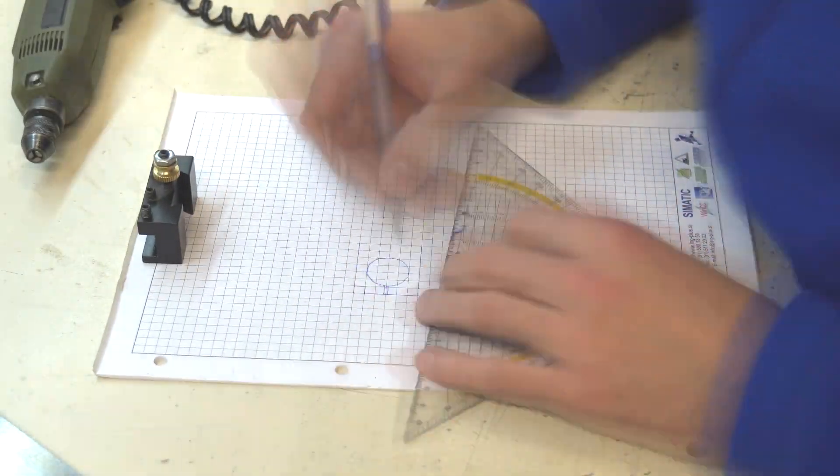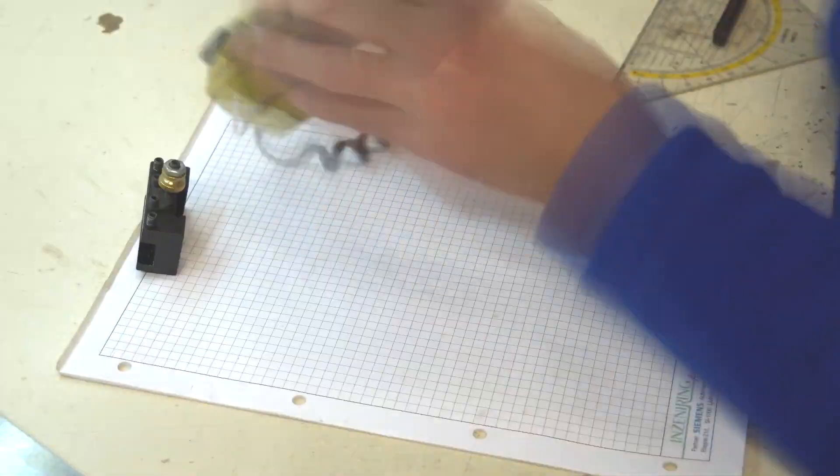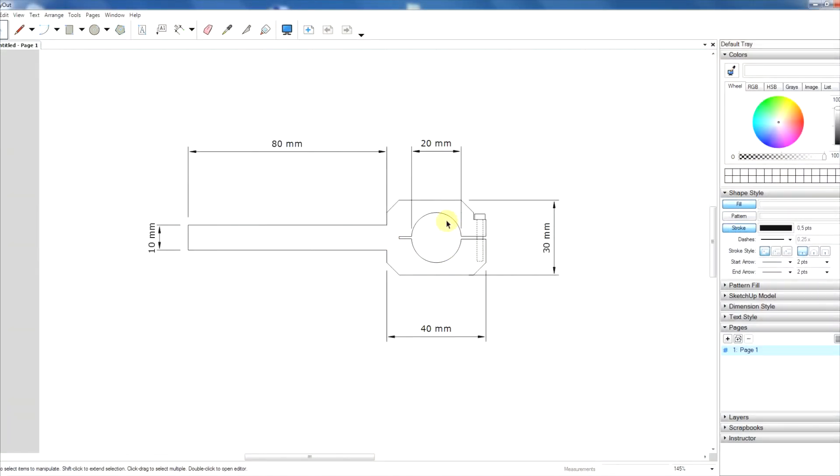First make some measurements and draw it for easier work. That's what I want to sketch. The piece is really simple to draw and also to make, but it's worth its weight in gold when you need it. There are just two important measures — one of them is the hole to clamp the drill, in my case 20mm. That dimension depends on what kind of tool holder you have. In my tool holder I can insert a max 12mm tool, so I make something between 10 and 12mm. There I cut the piece in half and add a screw to clamp the drill into.